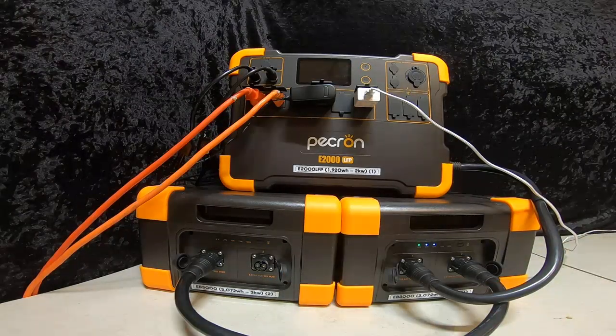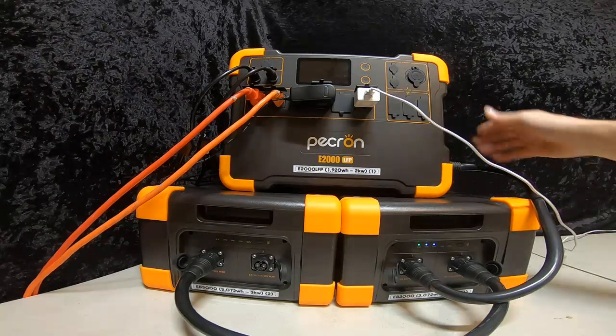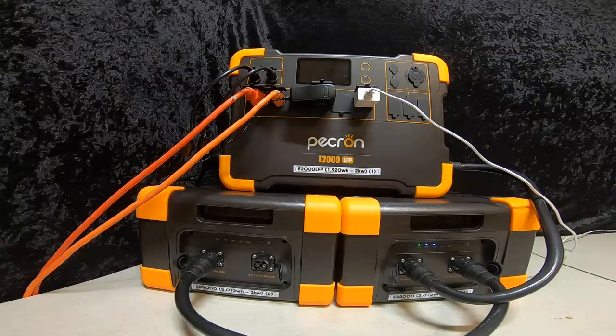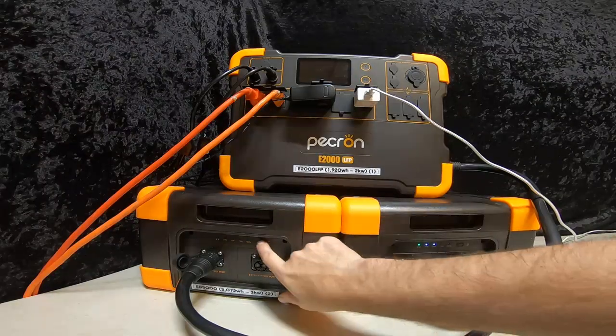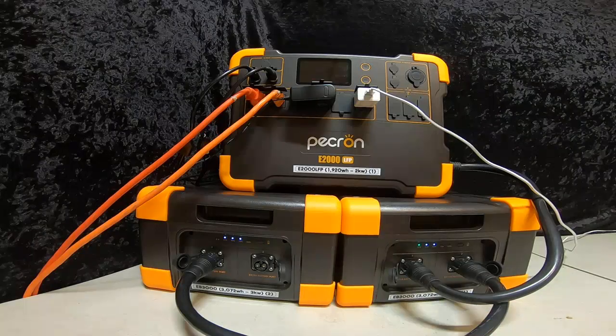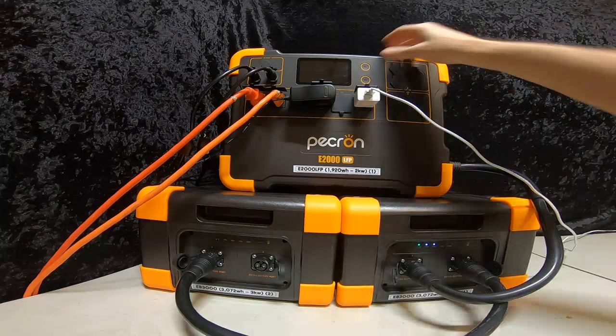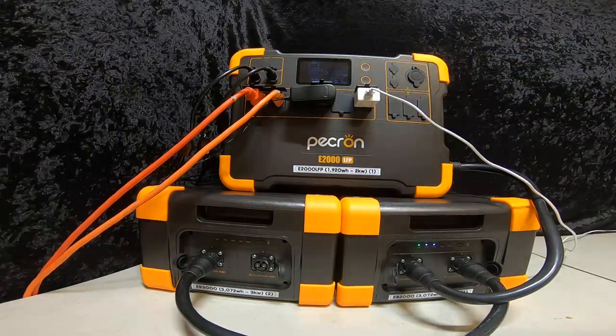So you have, it's properly set up, main box to 1, 2 to 1. That's exactly how PECRON has it. I think these batteries are very simplistically parallel set together, very redundant. And I really think, and it's just a theory, I think these batteries, either the shunts or the meters, just don't work. I've been running this system now for 2 days straight. Literally, it's 48 hours straight on that low current draw. Right now we're drawing 150 watts. I have 56% of the battery left.